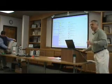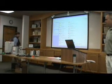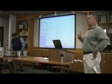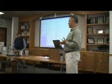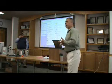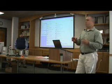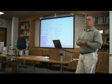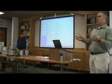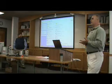I think the schematic thing is beneficial for anybody that's trying to troubleshoot these things. For the service providers in the room, David mentioned the requirements now. We've always seen high water alarms, but we're seeing a lot more elapsed time meters or event counters required in the panels now. And I have been to a handful of properties already where they were invaluable to know what kind of water folks are putting into the system. I wish everything could happen that way. Gravity systems, there's no easy way to do that. But the ones with pumps, man, they've saved our butts many a time to know what's going on with the system.